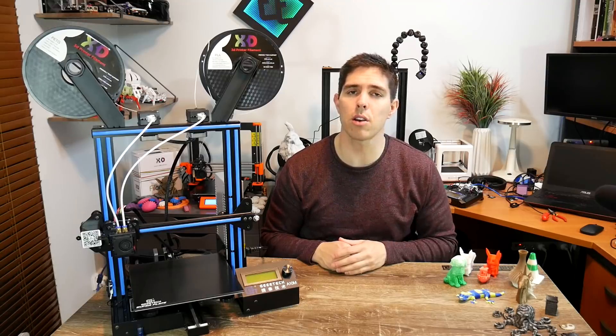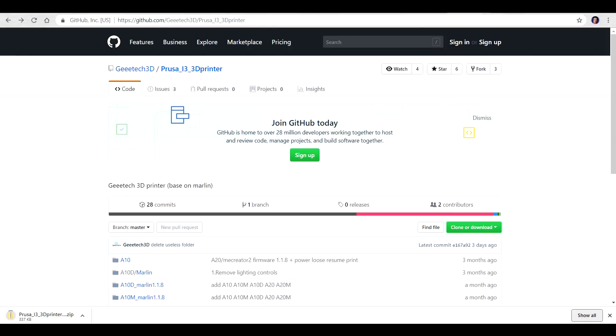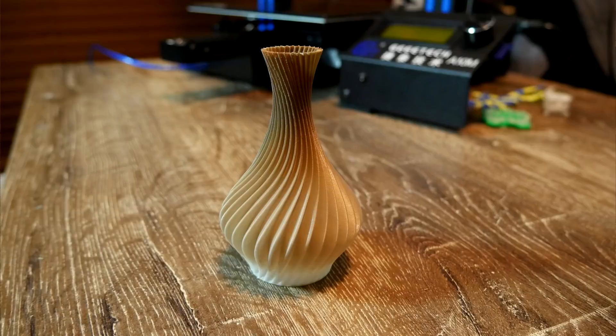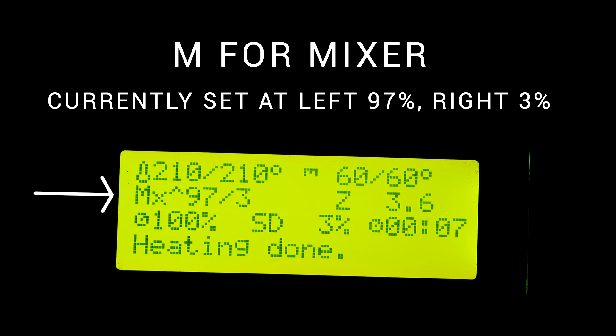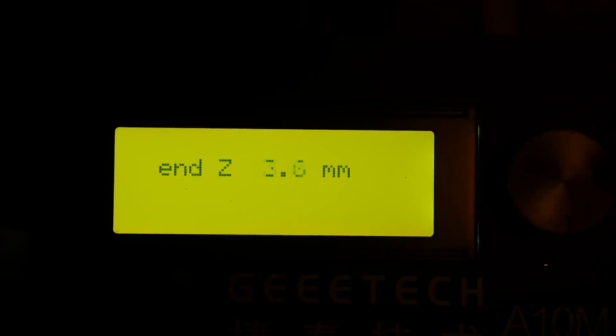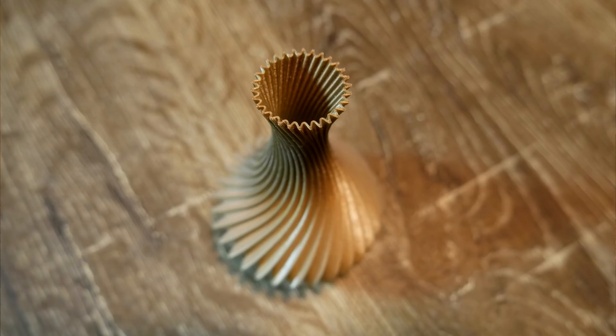My interest was piqued, so I started looking through the G-code to find out how these different types of prints were done. I looked into the Marlin firmware commands and found the firmware for this printer, which is kindly posted by GTech online. The first thing I sliced and printed myself was a white-to-gold vase in PLA. I didn't do anything in the G-code — I utilized the features built into the LCD screen to get an effect similar to the colour gradient dog. On the main status screen it says 'mixer' with a percentage from one side to the other. You can set this manually or use the template option, which lets you pick a starting height, ending height, and gradient shift. I matched 100mm to the height of the vase and told it to go from 0 to 100%, and that's exactly what it did. Really nice to know you can get this type of effect without learning anything new in slicing software or firmware.